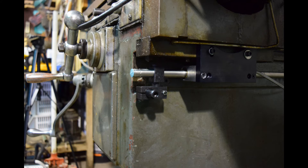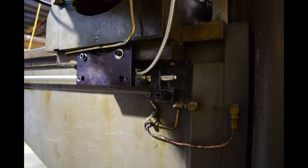Tighten all screws but the one on the support length that holds the scale. Again, repeat the steps as before, only this time in the saddle's most negative position, making sure that the scale slides back and forth through the reader head with little effort. To finish mounting the scale, slide the scale through the front support pin to the rear support pin and simply tighten the screws on the two support pins.